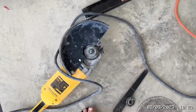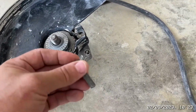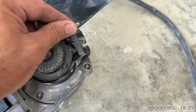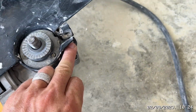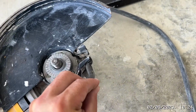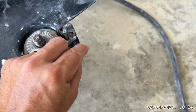So I've just got out the big grinder, let me show you. So, got the big grinder out, got the disc out. This bolt, which is for the shroud that protects your eyes from dust, etc., was actually put in the wrong way. So it was in the thread. There's a thread in here and there's a hole here. So that was in there like that. So I'm looking around for a nut that goes in here to tighten up. But in fact, someone has put this in the wrong way. So that goes through the hole into the thread.